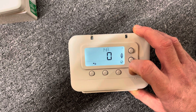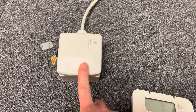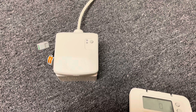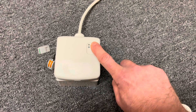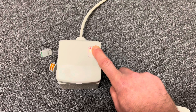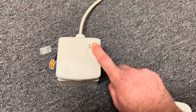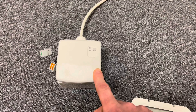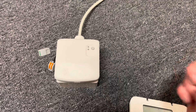You need to go find your relay box. If you haven't got this relay box, you need to replace it, because you will have issues with these two pairing to each other. I know a few sellers on eBay say you can pair them to the older generation relays, but you can't — you need the BDR91 or an equivalent. On the relay, you've got to press and hold the button for a full 15 seconds to clear the memory on the relay box. Keep holding it until you get the fast flash, which happens at about 15 seconds — it's off for about half a second then flashes on. Once you get there, press and hold it again for about five seconds until the flash changes into the slow flash. Then you can let go.